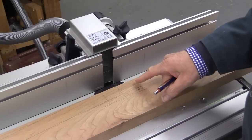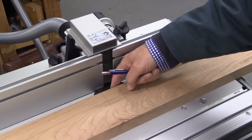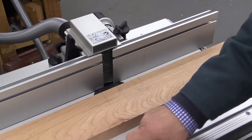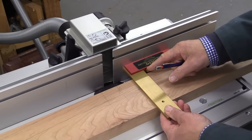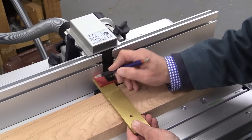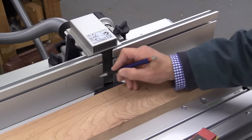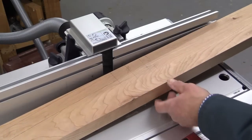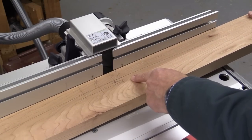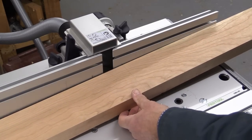The other thing to set up is where we can start and stop our cut. I've got this centre line lined up with what I perceive to be the centre line of the cutter. I'm just going to make sure that this is parallel to the fence — which it is, certainly close enough. What I'm now going to do is make a mark on here — there's one there and one there. So that's the limit of my cut. It doesn't need to be terribly accurate because we're going to be finishing these legs. So it now means I start my cut with the centre line at this mark and continue it to the centre line at that mark, putting the groove all the way along there. I can then turn this over because my cutter isn't long enough to go all the way through, and I repeat the process on this side.